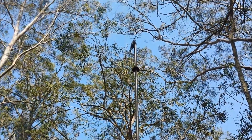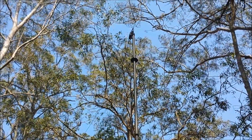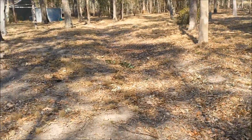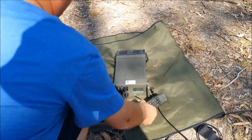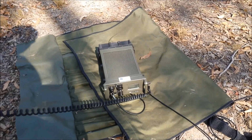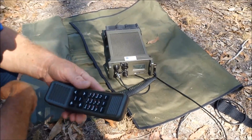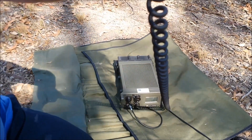So we now have a 48-metre long, inverted-V, true-dipole, true-broadband antenna. Moving down to the ground, we've got a Barrett PRC-2090 military radio. We're going to do a quick on-air test — a beacon call on around 10 megahertz into a base station about 900 kilometres away. I'll just do that now and you should be able to hear it on your screen.